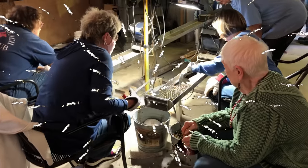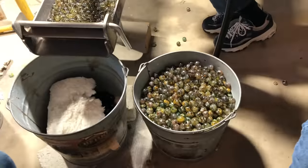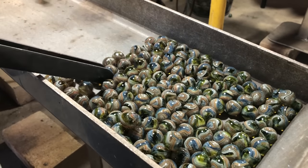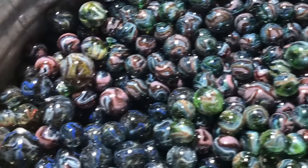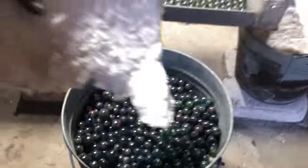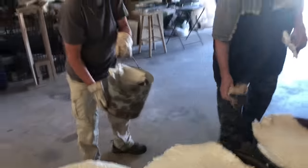These marbles are still dangerously hot, and you can see how dull the colors appear in the sorting stage. It takes about 15 minutes for a scoop of swirl color to melt down and join into the stream of glass, and it takes about another 24 hours for the glass to fully cool and cure to where the colors are bright and true. When each pail is filled, they get picked up and dumped into 65-gallon drums, and they'll cool there overnight.